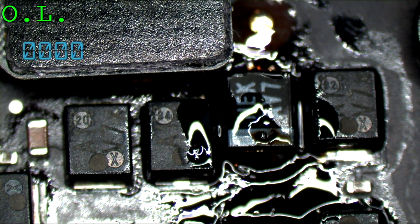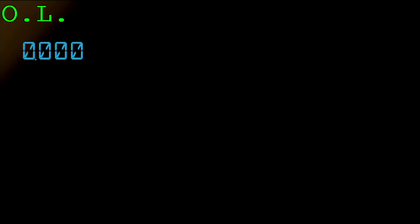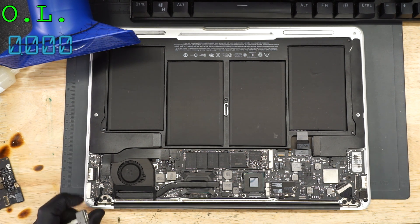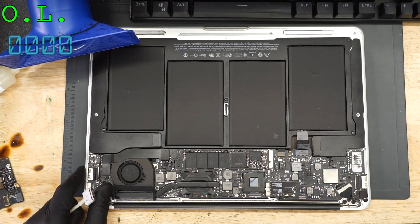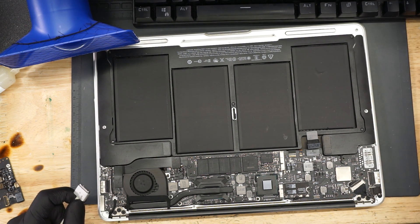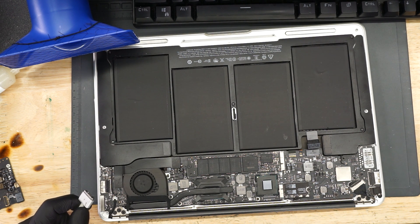Once it cools off, I'm going to see it turn on again. When I plug it in, it's not going to take 255 milliamps because it was being drawn into a short — it's going to take 500 to 600. This is an Ivy Bridge, so probably closer to 600, and then it will work. Paul saw that I got this board — he'd be so mad, he'd be storming in my office right now, probably with a BB gun. It's a good thing Paul didn't know.